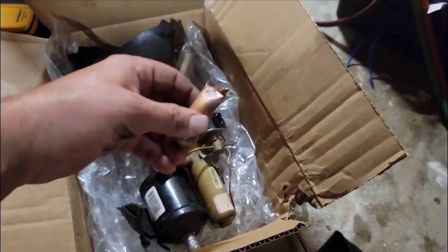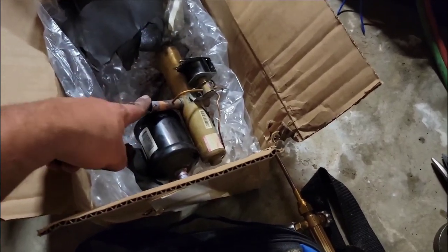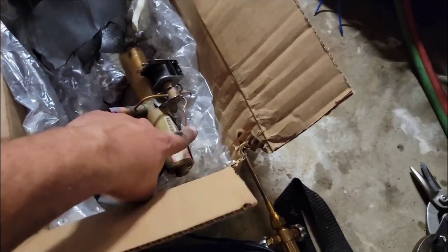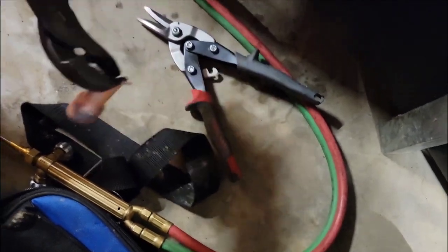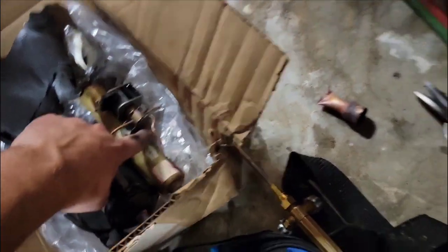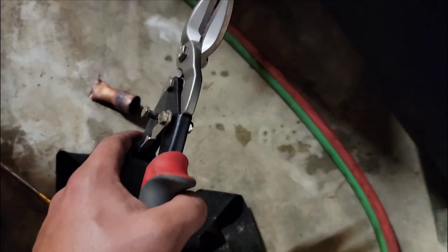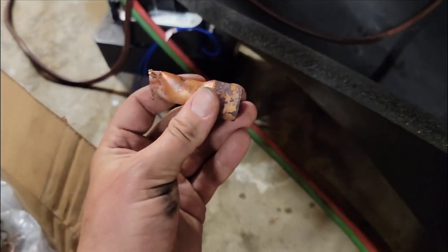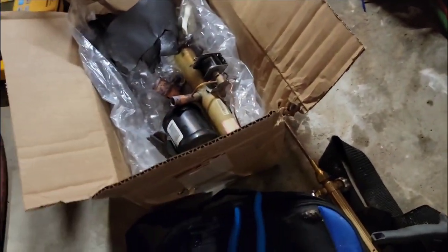Here's the old reversing valve, and I'm going to give you a tip about taking it out. This little half-inch connection — the discharge line that comes into the reversing valve — is easy; you can unbraze it and pull it right out. The other three connections with the 7/8" pipe are a little harder. What I do is take my channel locks and squeeze right at the valve, then take my snips and cut that copper pipe. The reason I do this is because it's so hard sometimes to get each one off individually by unsweating them. I'll cut all three, or sometimes cut two and then unsweat the last fitting — then you can unsweat each one and pull them right off. A little tip for you.